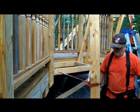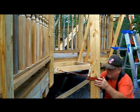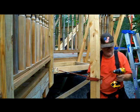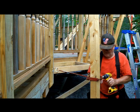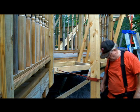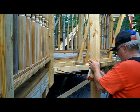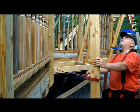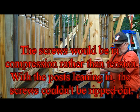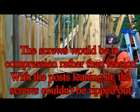Oh, one more thing. I like to get that horizontal. And I'll put a screw, there's a hole here, so that you can keep this connection to the post in its proper place and not have to rely on the compression of the wing nut. And that's it. It's done. And it's not perfectly perpendicular. I purposely set it so that it would lean in towards the gazebo a little bit. I feel it's a lot safer doing it that way. So anyway, three more to go like this.